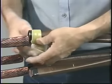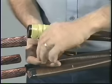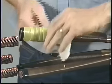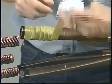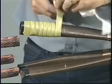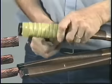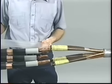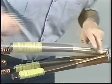While removing the remaining backing strip, tightly wrap one half-lapped layer of SRM at the end of each phase, up to the insulation mark, stretching it to half of its original width. Be sure to wrap the SRM in the same direction as the insulation papers. Repeat this step for the remaining phases. Now, place the clear oil barrier tubes over each phase, butting it to the lead sheath cutback.